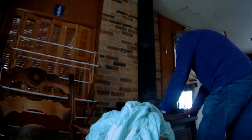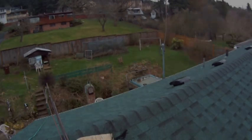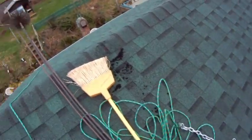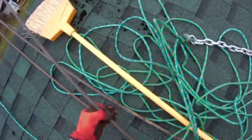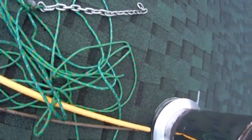Nothing more there. Alright, so now that that's done, you can see that's the damper there. See if I can get it to release. There's something going on here. Alright, next thing is just slide out the wood stove. Yeah, very carefully. Okay, the next thing to do is to push down one of these chimney sweeping brushes, and then we'll add pieces as we need them.